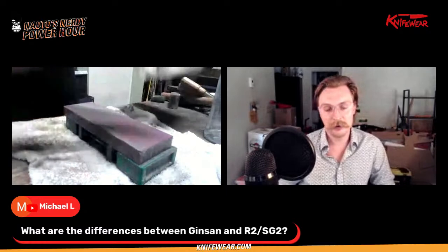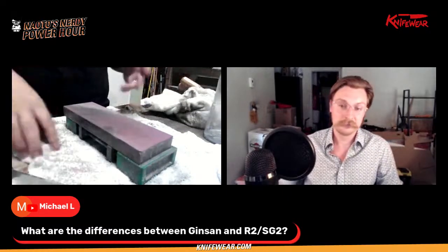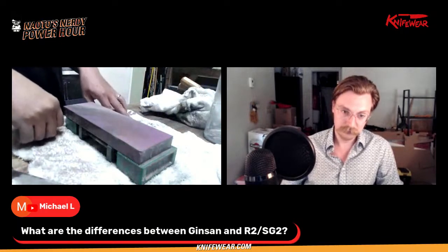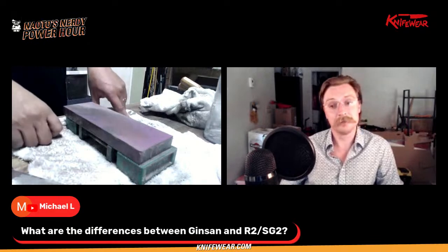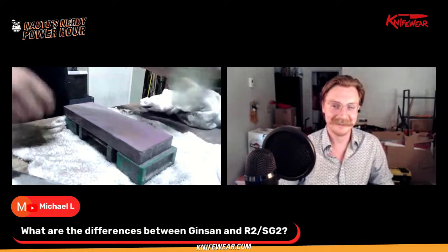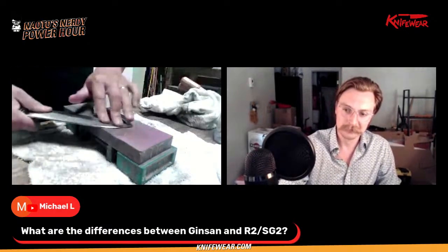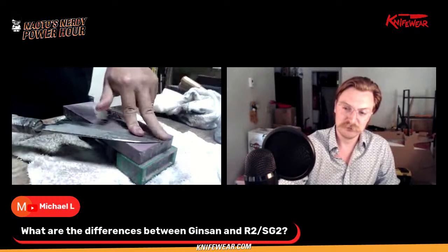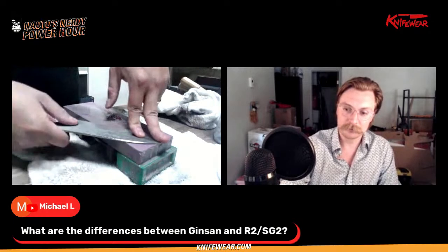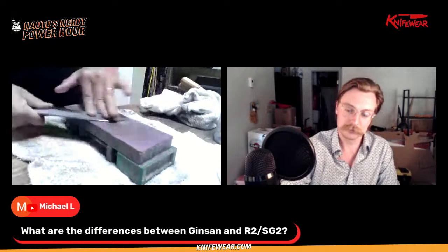Huh. So it's actually high-speed powder steels, or high-speed steels, that you could sharpen with the super aggressive belt sander without losing its hardness. Oh, okay. Cool. Hopefully you don't have to, but if you do. Yeah, exactly. That's why it's called high speed. It was designed for drill bits, for cutting, like dentist drills and stuff like that. Right. Fast, and it could heat up a little bit.